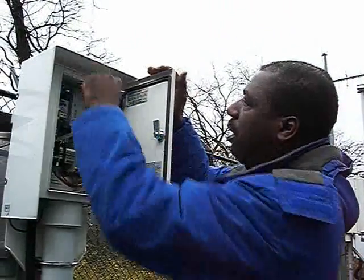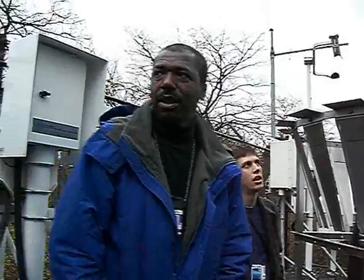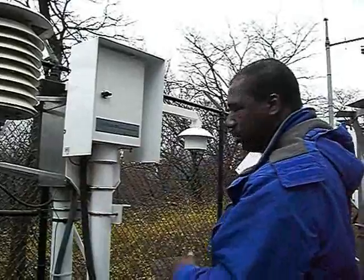This site itself is a non-standard site. It's very unique because the ASOS system was primarily designed for airports — it's actually designed for the aviation community. This site was actually modified because of over 125 years of weather data collected specifically here. The actual ASOS layout is on a monorail — this whole set will be on a rail. So you have the tipping bucket first, then the temperature sensor, then the liquid water sensor, all in an array. It's standard throughout the entire country — there are over a thousand of these sites throughout the United States.